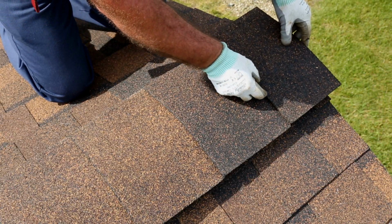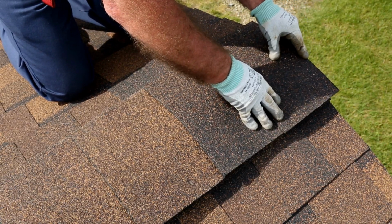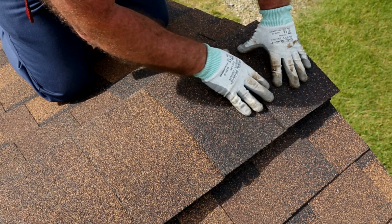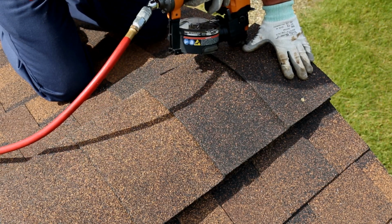When finishing the ridge, leave no laminated portion of the last hip and ridge shingle exposed. One option is to use the 8-inch exposure portion of a hip and ridge shingle, cutting a piece the appropriate length to extend over the laminated portion of the shingle to the edge of the ridge. Fasten the final piece with 2 nails, each 1 inch in from each side edge.